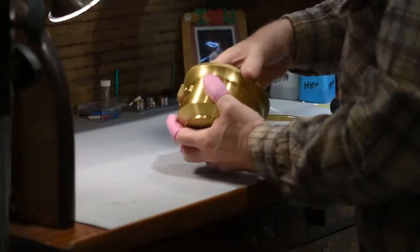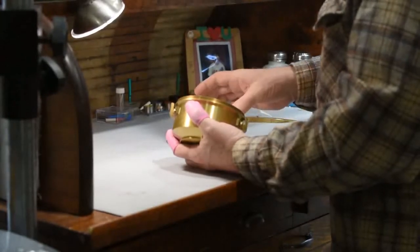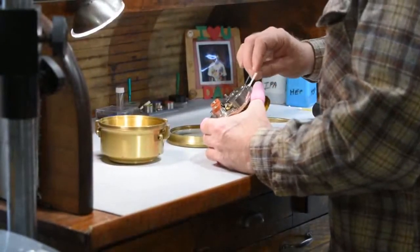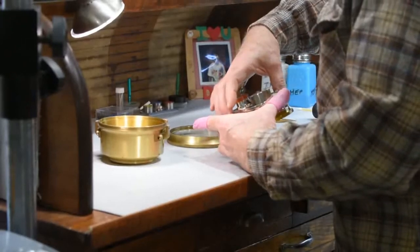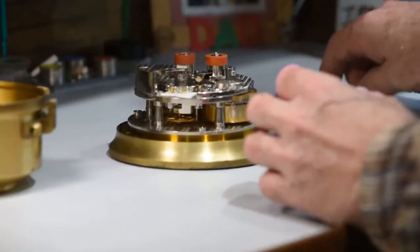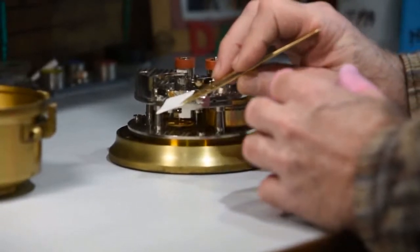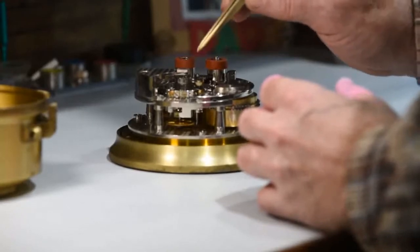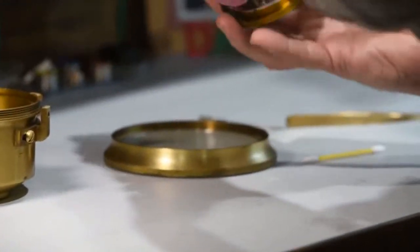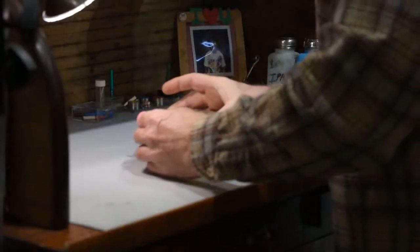Let's assume you don't have the balance brake and you've just received the chronometer from us — it will be cleaner than this, with a little bit of wind on it. Remove the wedge. For the moment, you want to avoid moving the balance. Line up the key and the keyway. The balance is stopped.